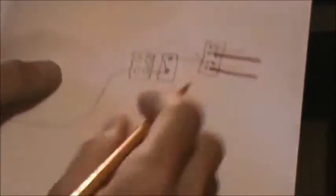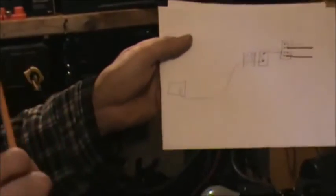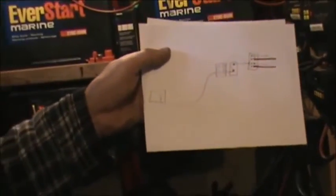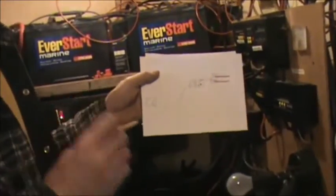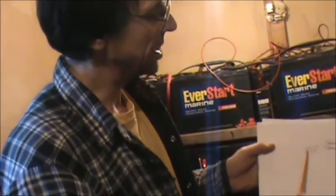The way I'm rigged: I've got my generator running outside in my shed. The power goes to a set of plugins first — the hot carries through just an ordinary light switch, then off to my transfer switch. I get to control whether I want the house to run on the inverter or the generator. With a large enough inverter you can have a very small generator and still run laundry.